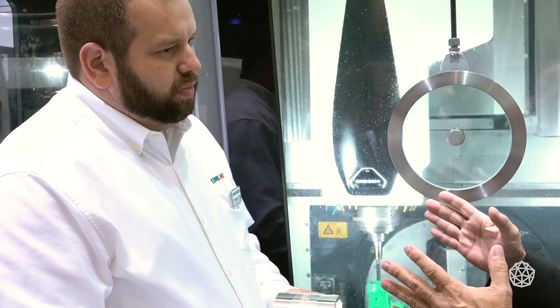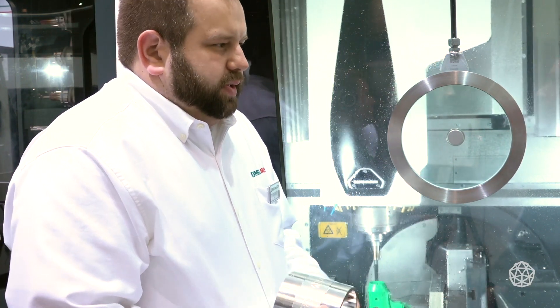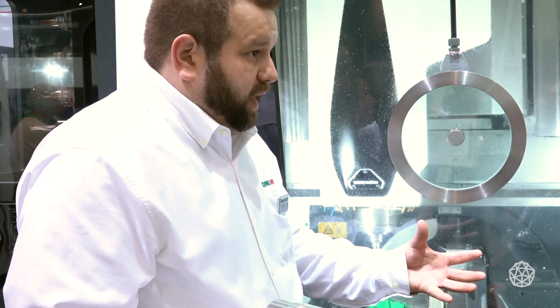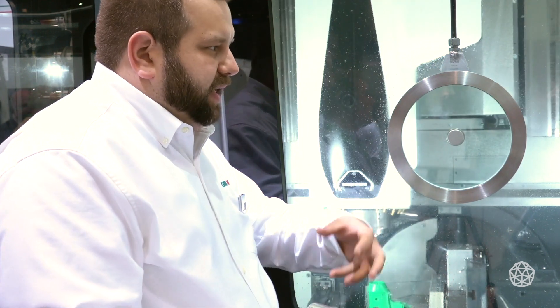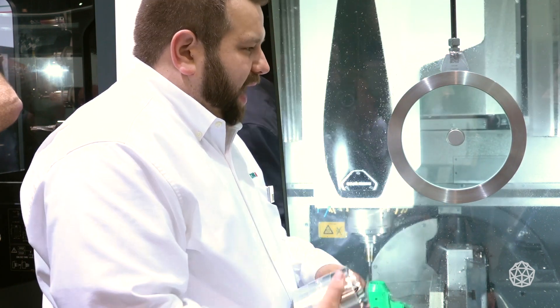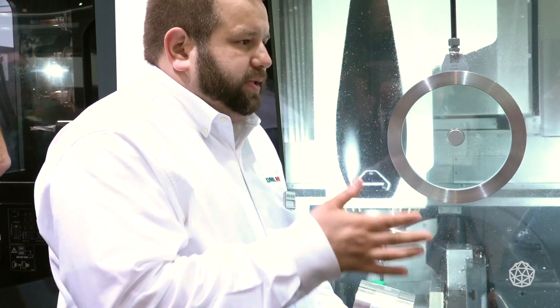People fall in love with horsepower and spindle speed, but overall it's cut-to-cut cycle time that really matters. How important is that setup time issue to a productive operation? As an application engineer for DMG Mori, we always talk about cut time — and I think cut time improvement from manufacturer to manufacturer is going to be around a 10 percent reduction. But the biggest thing I've seen is the reduction in setup time and the overall process for their part. If we can take someone's changeover time from an hour to a half hour, that's where they're going to see the cost benefit.